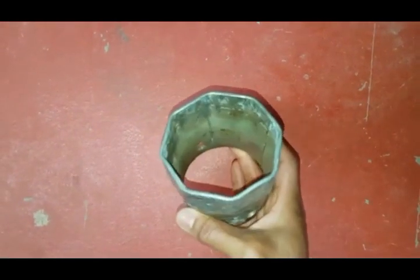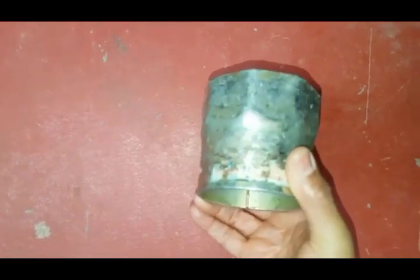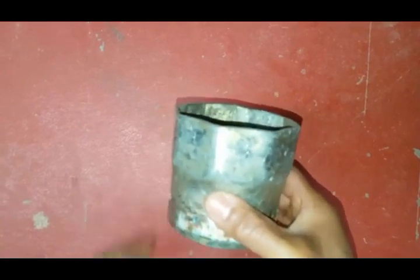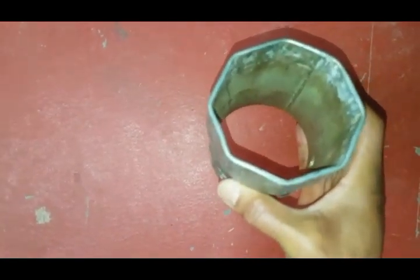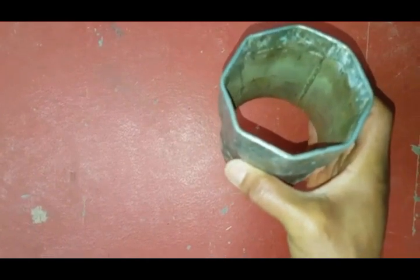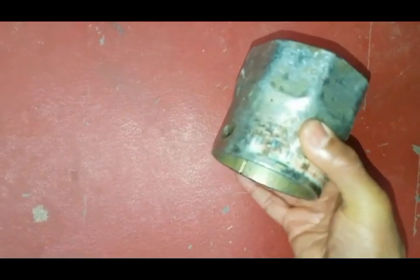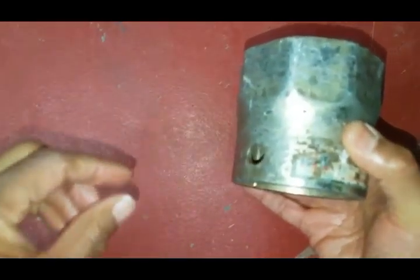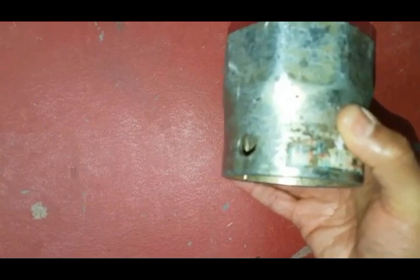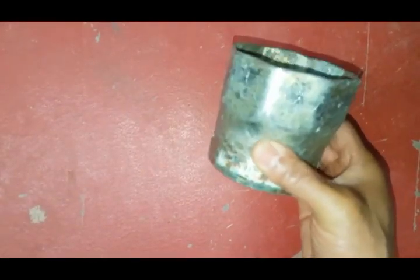This is the immersion heater key which I just mentioned. It uses a big grip here and fits all immersion heaters. You use these for unvented cylinders to remove the immersion heater — so that's a handy tool to have. You do get a lever that goes through the hole here, but it's not very good for leverage, so it's best to use the big grips I mentioned before for this type of application.